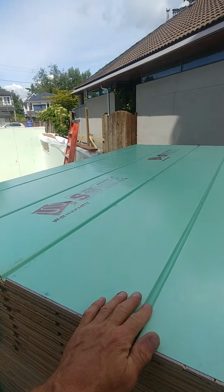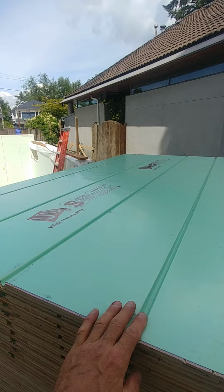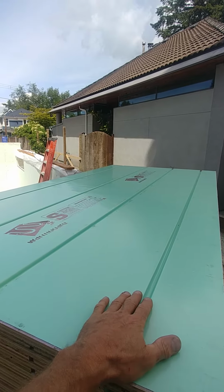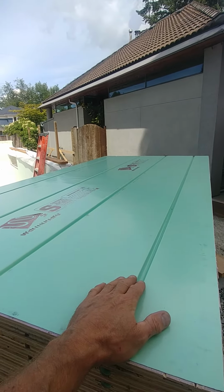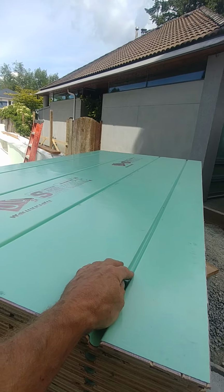We just put the tubing in here, and it's usually done later, before we put the floor in or before we put the drywall in. So we have it all done and down in the holes and through the channels that we need to run it through, and then cover it up again right after that, so it doesn't get damaged until the floor finishing gets done over top of this. So it doesn't require any concrete on it. It's 1.1 inches thick, so it's super strong.